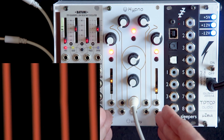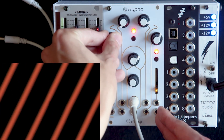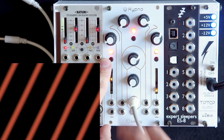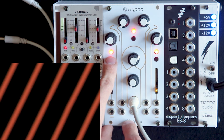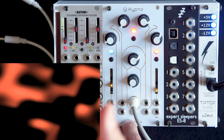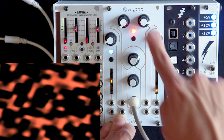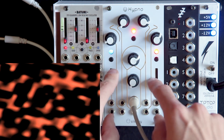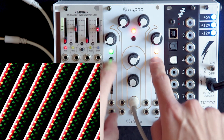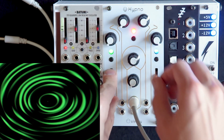For the two sides, going from the bottom: the slider controls the frequency — more shape, less shape. The next knob controls the rotation. Then you have your polarizer, which takes your shape into circular coordinates. The button controls the shape: the red one is a sine oscillator which just makes lines, then you have tangent which gives you a line that's brighter on one side, then boxes, and finally noise. These can be controlled independently, and all of these controls are mirrored on the other side for the second oscillator. The shapes, rotation, and polarization can each be controlled independently — the polarization is actually slightly different for the two sides, just for added flavor.